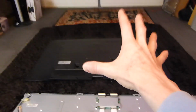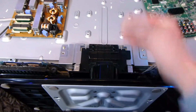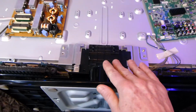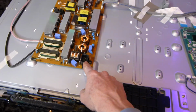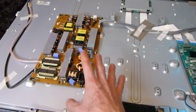You don't have to completely put the back on to test it. If your stand is on, be careful setting it back up because that might still be loose. Make sure that it is stable, but lean it up against something so it doesn't fall down. Plug in your wire right here, but be careful not to touch anything with metal, causing a short or anything like that. Fire it up and test it before you have to put it all the way back together again.